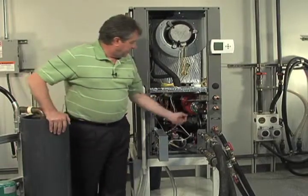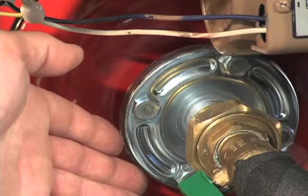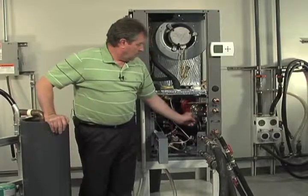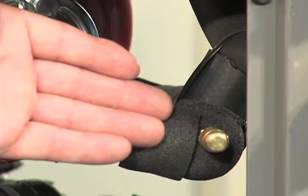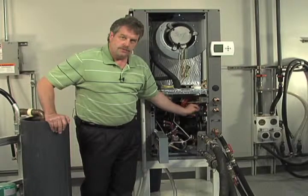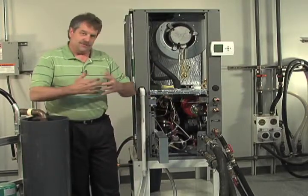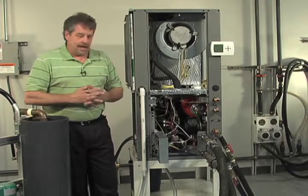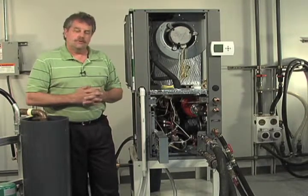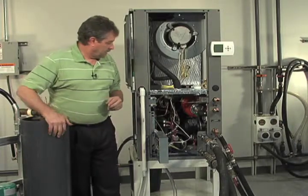You're going to see some other things in here. We have an expansion tank. There's some things you need to know about that. I'll cover that as we go through the process. We also have here a bleed port so that we can bleed that air out all the way back near this expansion tank. That's important, okay? So we can find out if we've gotten all the air dislodged. You can't skip that step of bleeding that, or you will actually have some entrapped air in there and create a lot of additional time trying to flush that air out of your system.